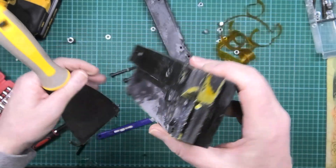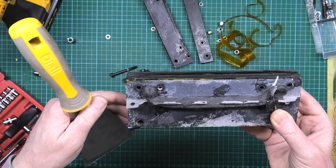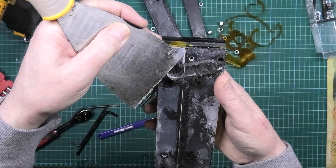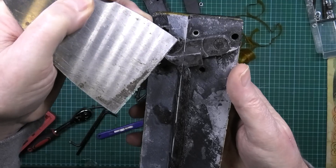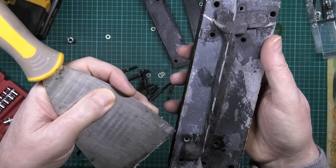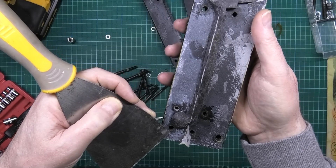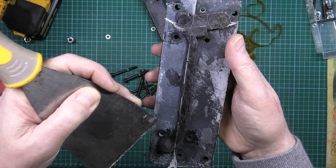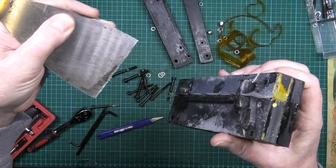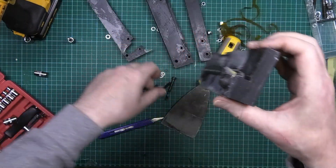It's all there. This is where I've got to be careful about what I take off and how I take it off. This is split — if I were to try and pull that off that way, there's a mechanical lock there and that would break the mold. The same here, the ball is actually a mechanical lock. So the only way I can do it is split it down there and then pull that out. It's come off — this is easier than the last one.